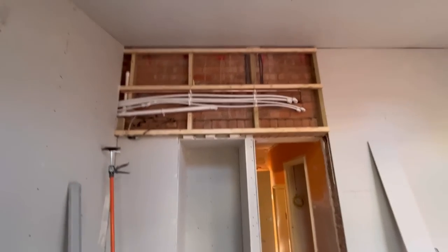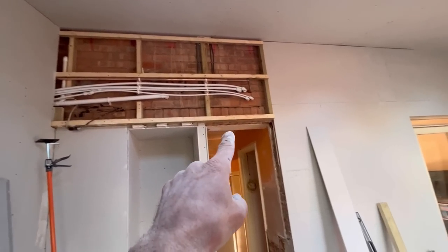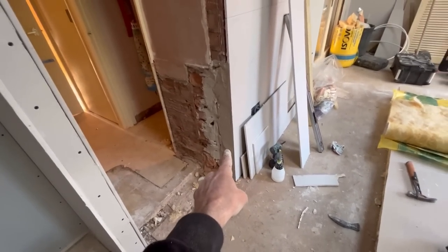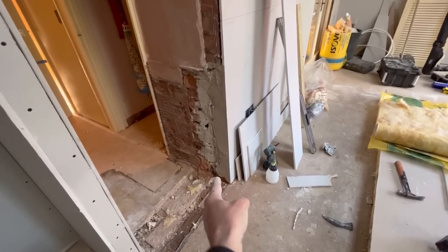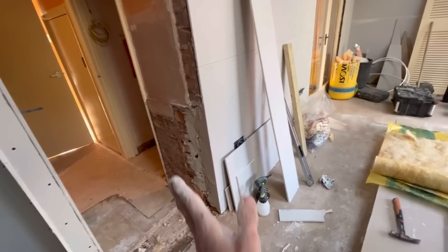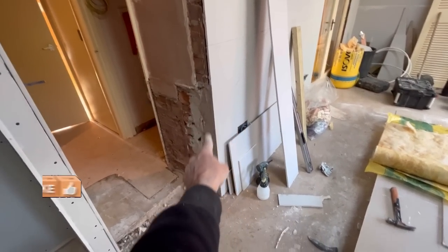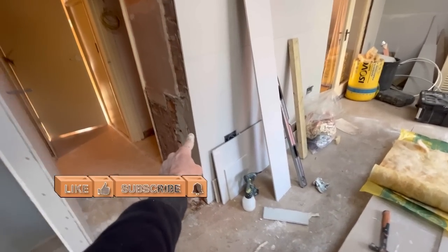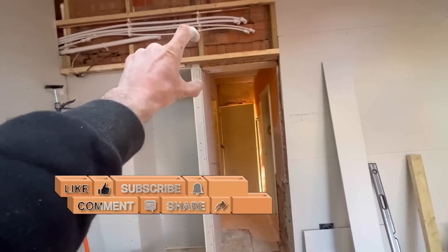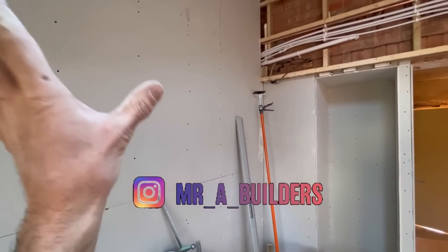So there we are then. We're going to get this boarded now. I'm not going to put my frame in because we've used the last of the bonding. Last of the dab board adhesive on that brickwork there, where we were a bit overzealous, should we say, with our cut. So I've just put that in there. So at least tomorrow I can pack off that when I put my door frame in and put this head in. But we're going to go next door and complete that now and get some insulation done, I think, to allow that to go off.